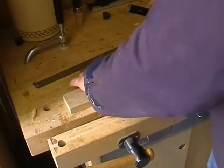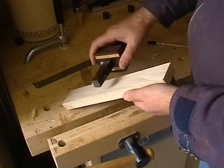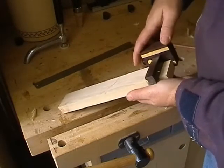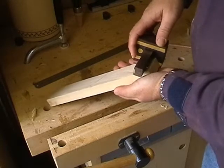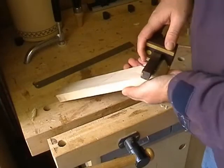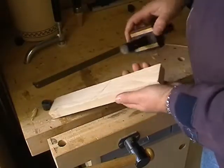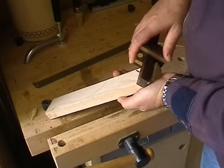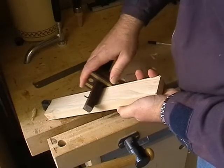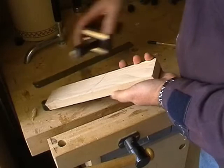To put it on the wood, it's got to go face side. I turn the point towards me, thumb and finger around the marking gauge so that I can push in as I drag it down. I need something to push against — a bench stop would be nice. Pushing in as I take it down, holding it tight in against the face side, face edge, and down we go.